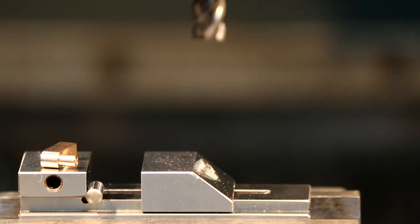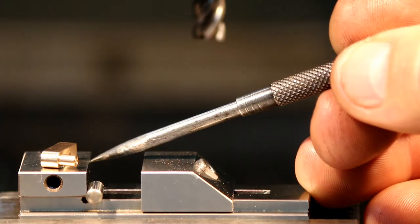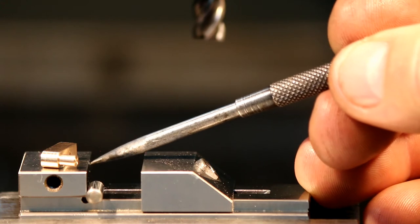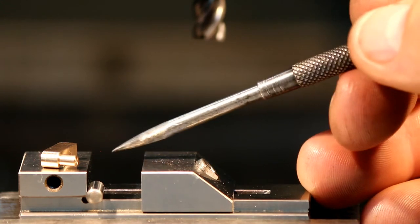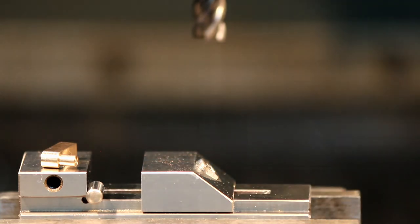Another way you could do it, I mean, it is just a port for steam. I could just use a 3 millimeter dowel and maybe a 10 times or 15 times optical eyepiece, and I could just shine light at the back of the mill and just look through with an eyepiece and just pick up when you see the daylight disappear on each side. You can call that zero on the digital readout as well if you want to pick up center. It's only a port for steam.